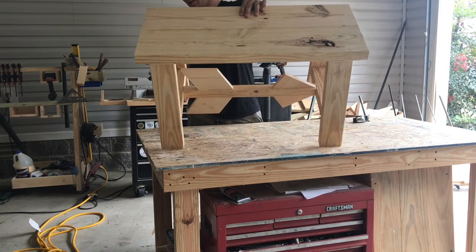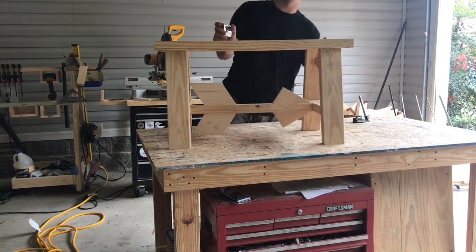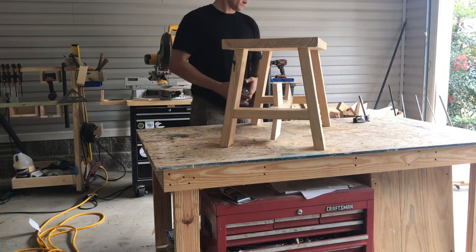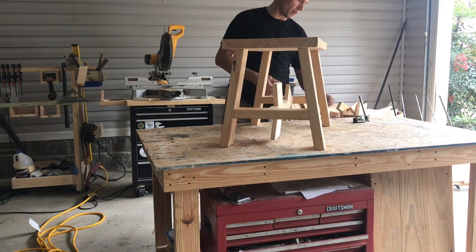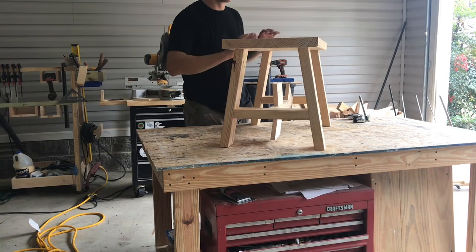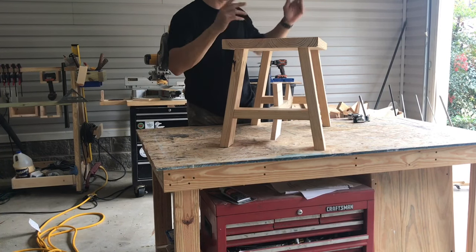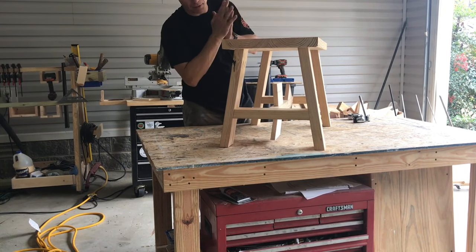To give you the key measurements: you're going to need 16 and three-quarters on the leg, long to short, with 10-degree angles on each side. The stretcher is a 12-inch piece. If everything is square when you put everything together, this bench won't rock. I usually round over these edges with a three-eighths-inch round-over bit and then round over the feet so there are no sharp edges. Sand it, and then you can paint this one or stain the top and paint the base — whatever combination you want. This bench design is conducive to really anything you want to do with it.